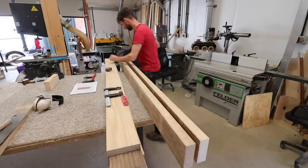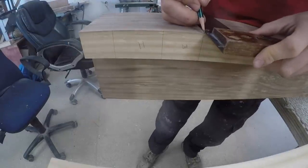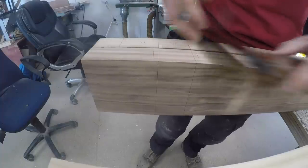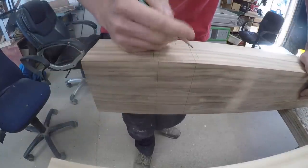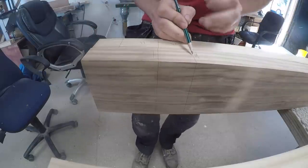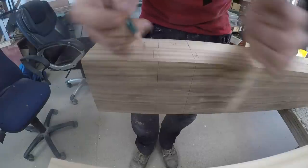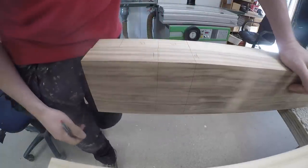And voila. Same for the top. Something like that. If you want to get your wedges really even on this side of the door, you want to have a slightly bigger wedge room on the inside, where there is a really tight joint between the rail and the cut on the mortise. And on the outside here, you have a tiny bit of wiggle room when you cut the actual tenons down to fit in the door. So you might allow 1mm of wiggle room so you can physically get the door together. So you make this wedge room slightly less than that inside, but it's not too essential.